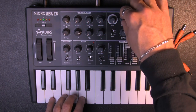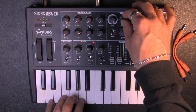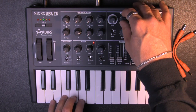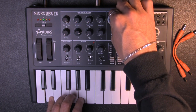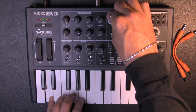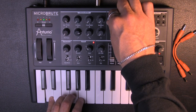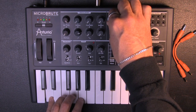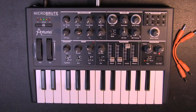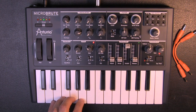And of course, here we can go into the self-oscillation of the filter, where the resonance amplifies a particular harmonic to the point where it becomes audible. You can hear the harmonic range there. And that is a pretty hardcore sound. It's sort of a characteristic sound for these 12 decibel per octave multimode filters.